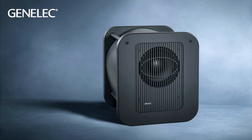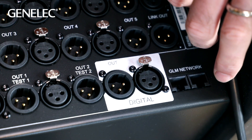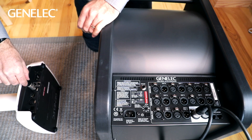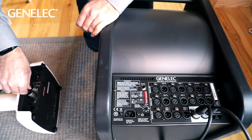If you're connecting a 7360 or bigger Pro Series subwoofer, then the setup can be done like this. Both the 7360 and the 6040Rs accept both analog and digital signal in AES-EBU format. In both cases, the signals are first taken from the sound source to the subwoofer and from there to the 6040Rs. In the case of AES-EBU, one cable contains two channels — so from the source into the subwoofer, from there into the left or right 6040R, and from there into the last one in the chain. Everything with XLR to XLR cables.